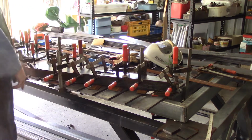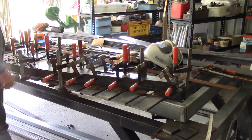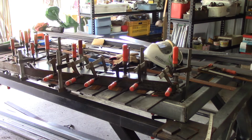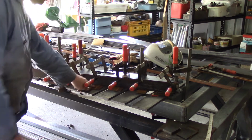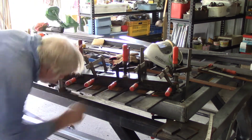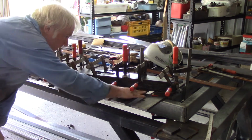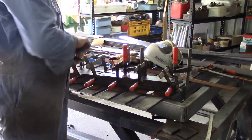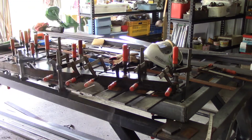I've put the top cap on this front section first. The plan is, once I get it solidly tacked on there, I'll start to bend it around here, much the same manner that I used for the longerons. I've used pieces of 3mm, well not scrap pieces actually, these are the formers for the other side, to make sure that I got the 3mm gap underneath. That's about as good as I can get it, I think.